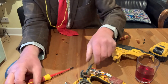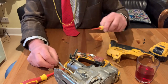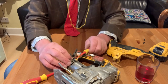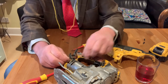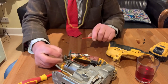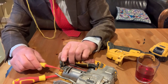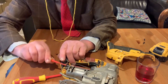So what do we do now? We've got to take the brushes out. Now where are the brushes? Well, this is the slot where we push the screwdriver in to spin the motor. And this is the connecting wire here. So you take the connecting wire off — just pull it off like that. Then we'll take these wires out of here as well. We've got to take that out there. And then you've got to get the brush out — the brush is here. What I do is get the screwdriver in the back and give it a little wiggle here, and a wiggle on this side like this. You can see it's coming up.